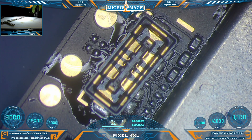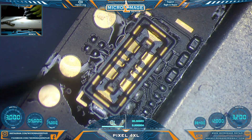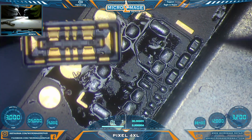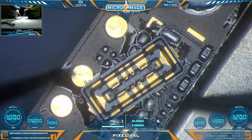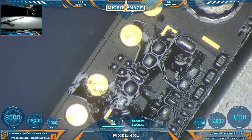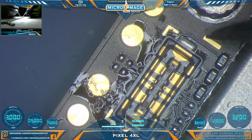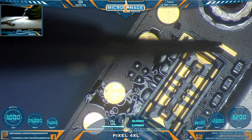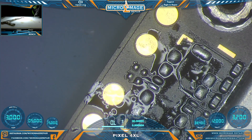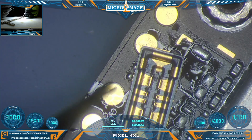We're going to drop our airflow down to about 20% to start, and we're looking to just tack that connector down. Oops — I'm not blowing it off. False start. These are the things you have to deal with, though. Get it back in place, roughly. I'm just not having much luck here. 20% really shouldn't do that, but hey, it's doing it today. I'd really like you to stop blowing off — but it's not going to stop blowing off. So what I may do here is try to tack this down by hand, at least one anchor, so we can stop doing this nonsense.